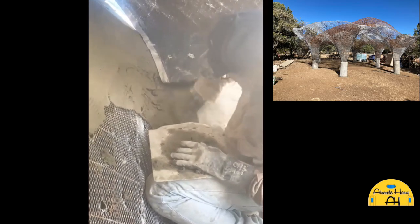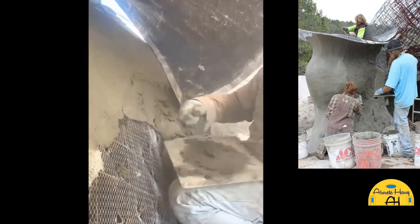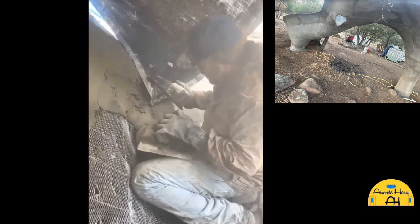And then you're having to try to float and smooth out something that's already kind of set, and then you're trying to push on your second layer on something that's already set, so it's cracking. So I try to really emphasize this: do one little tile and move on. It's just as fast as trying to do everything at the same time.